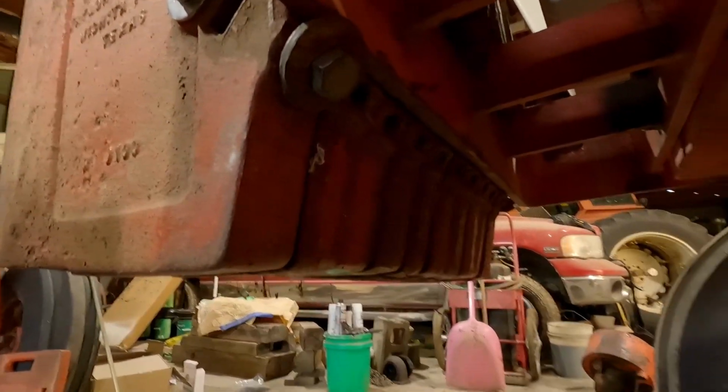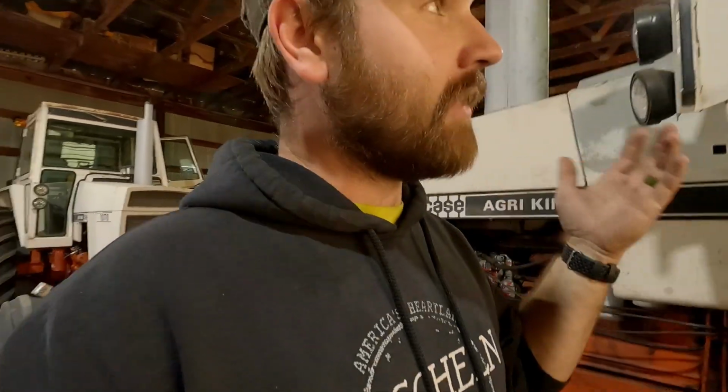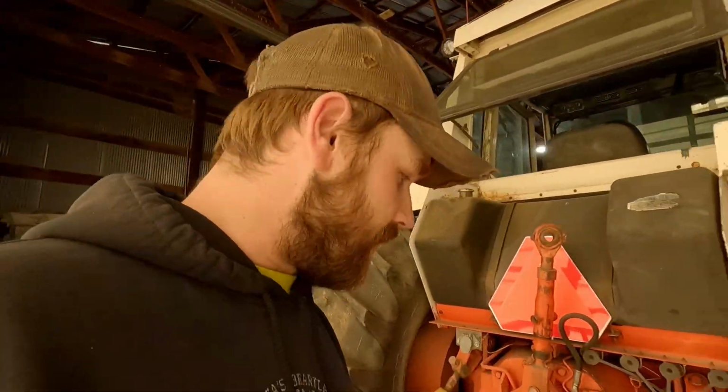tractor itself. And I also was working at some wiring inside the cab, and I figured out that they had things wired wrong, hence why I had flashers when I was supposed to be having the field lights. I had the flashers going too, which it's only supposed to be working on one setting. So anyways, I got all that figured out.